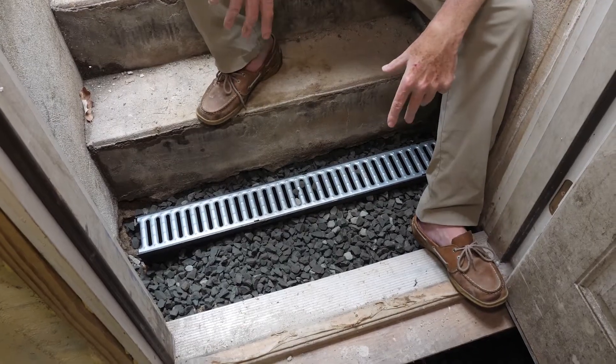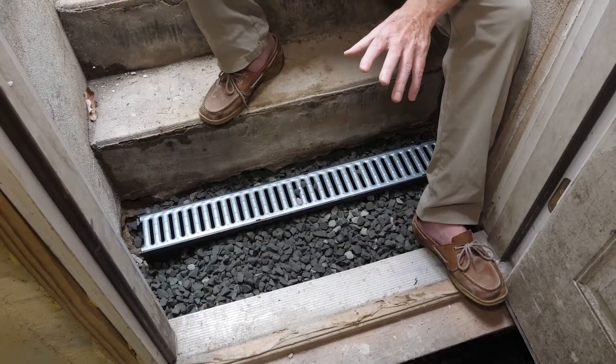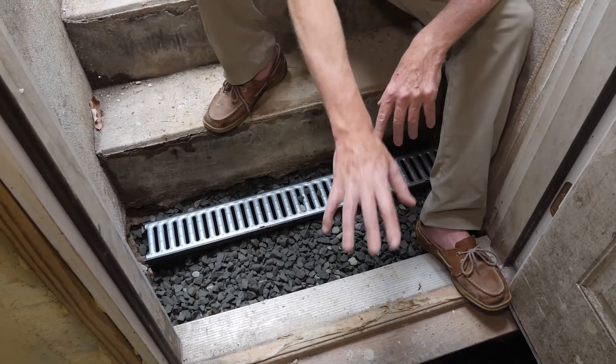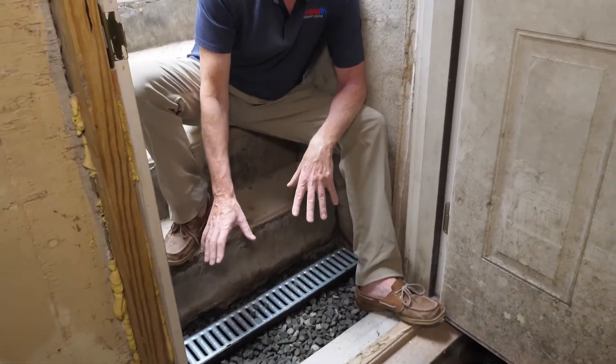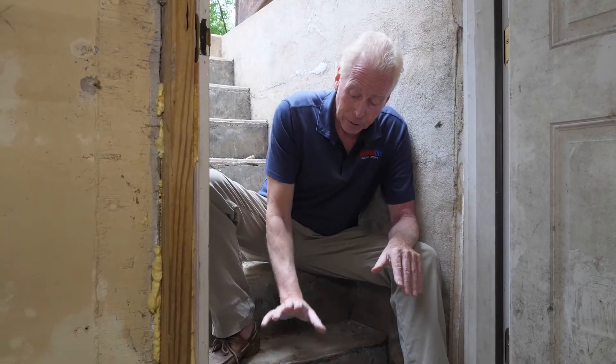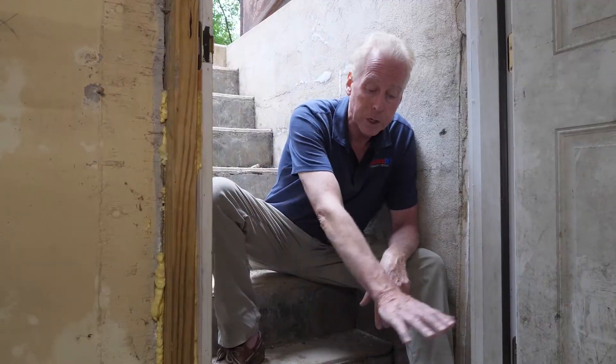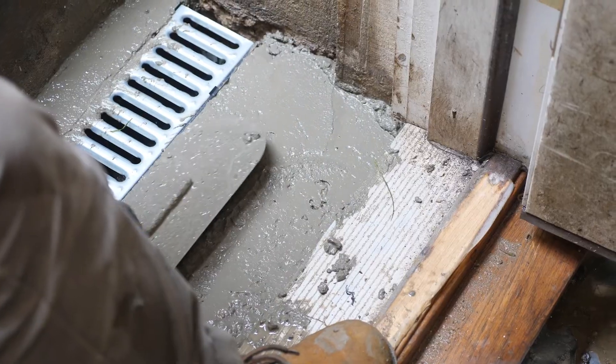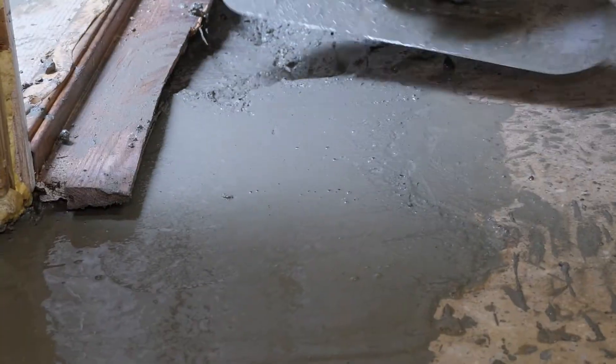We've completely torn out the old system and installed a drain that's over twice the size of the drain that was in there before, in a complete bed of stone that's going to facilitate drainage down into ours, which is way below where this drainage was. Water flows downhill. The old setup had this drainage actually below where their interior drainage was — there was no way water was going to get in there, so it would just fill up and flood the basement. This is all cemented in so any water coming through the Bilco gets directly into the drain. You can see the nice clean setup we have through our PVC right down into our corrugated perforated ADS pipe, pitched all the way around to the pump. If you like the video, hit like and subscribe. Until next time, enjoy your dry basement.